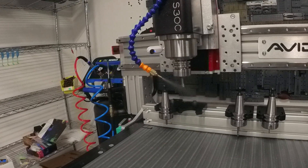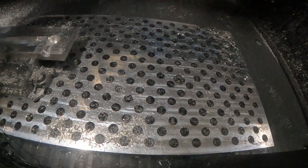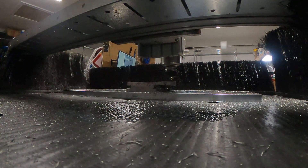Another big con is these machines don't have full enclosures, and the way they're constructed makes it somewhat difficult to add one. The gantry moves back and forth, the NEMA stepper motors hang off the side — you'd need a slit in your enclosure or a much bigger enclosure that takes up more room. What I've done is screw in some industrial brush strip to the sides, which keeps most of the chips in place — at least the ones that fly low — though some still get out.